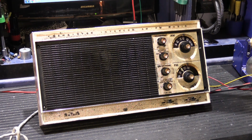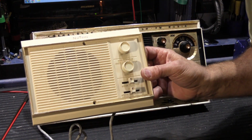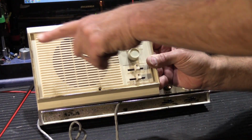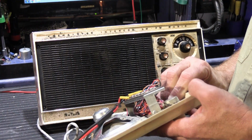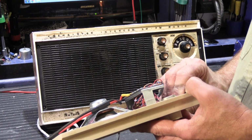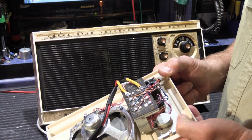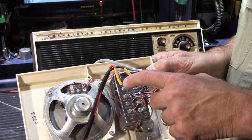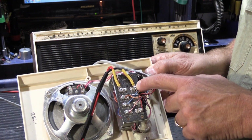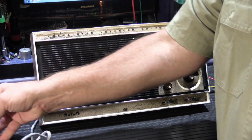I have it hooked up to an AM and an FM antenna, and to a single remote station and a door station over there like always. One of the unique things about the 2561 is, while it is a loop run and home wired system, entry door stations can actually be wired to the back of any remote station. They go on the black and black-white wire connections, and that's how I have this made up because it's just easier that way. So that's fine like that.